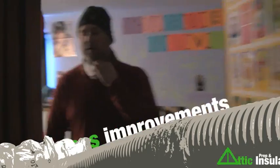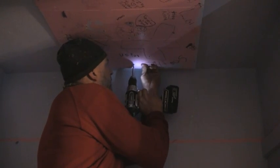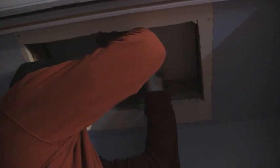On this particular house there are actually two attics. There's an addition built onto the attic, and we can gain access through one of the children's bedrooms. We'll take this off and poke our heads up there. What we might do is put a decent piece of plywood in here, insulate on top of that plywood, and also build an attic dam on this one.